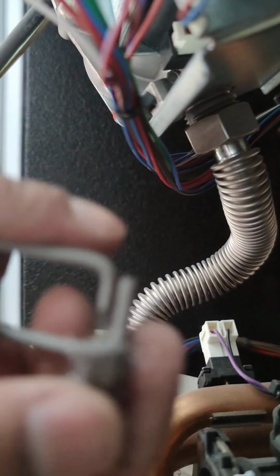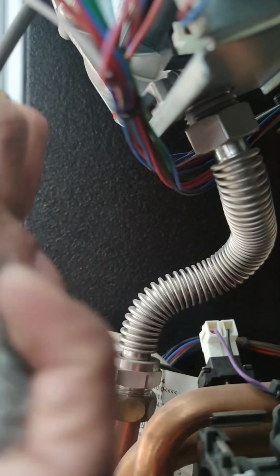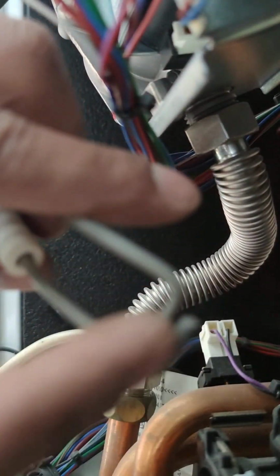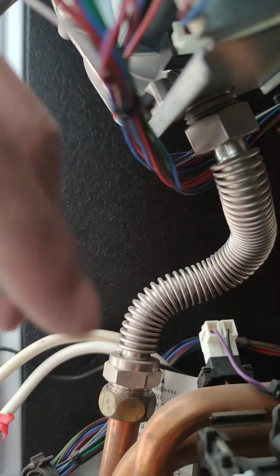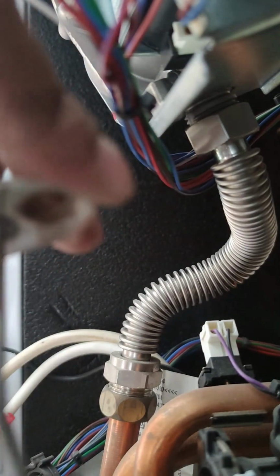So I will now clean this thoroughly. Make sure you give it a proper clean, so very thorough. Scrub it all the way around, and it's not just a 2-minute job, you know, scrub it properly for a good 10ish minutes to get around all the circumference of each of these probes. So yeah, take your time with it, make sure everything's off, and you want it actually feeling like the top where it's not been touched.